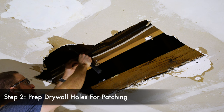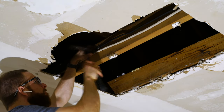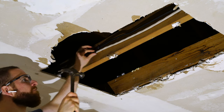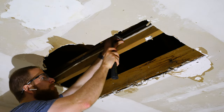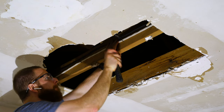Before cutting any of the existing drywall, make sure that all your electrical wires are securely mounted to the ceiling joist. When you start your repair, you might not have as large a gap as I'm working with here — I had such bad water damage that the whole area pretty much just fell out of the ceiling.